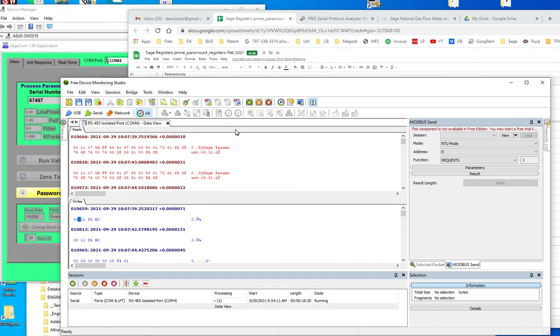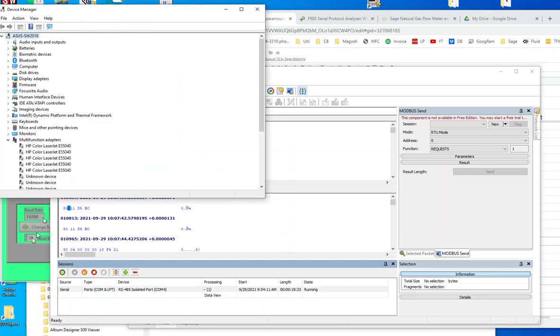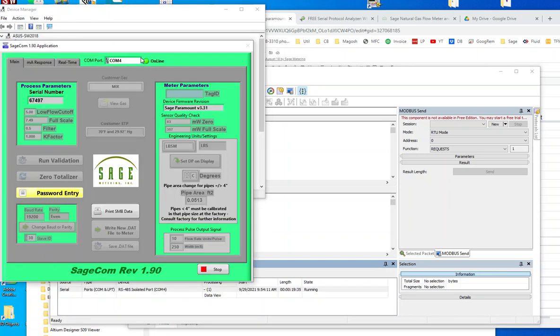Here is the read. This tool separates both windows — it knows TX from RX. You don't have to do any external wiring. You just plug this in and sniff the port you're working on. The port I'm sniffing is COM4, which is the same as the COM port on this device, COM4.